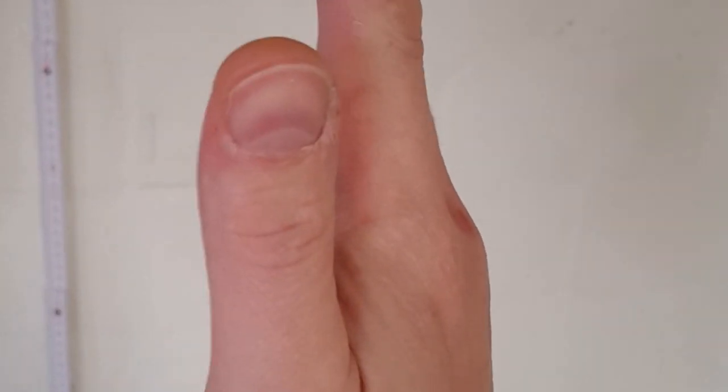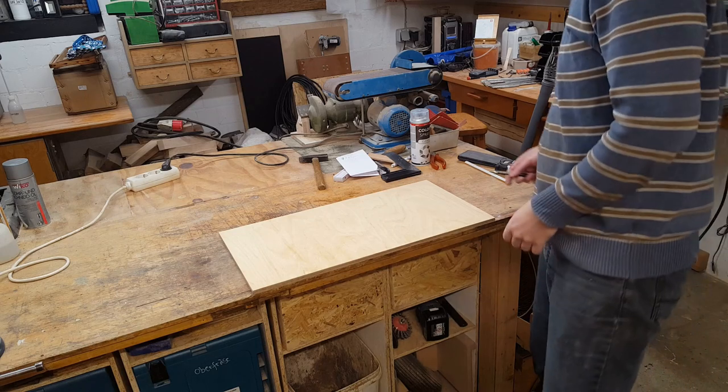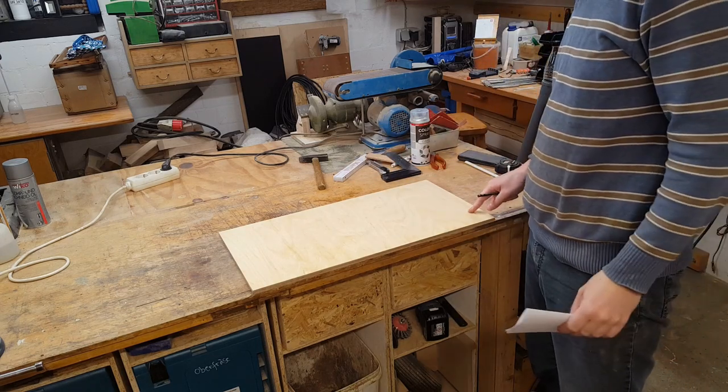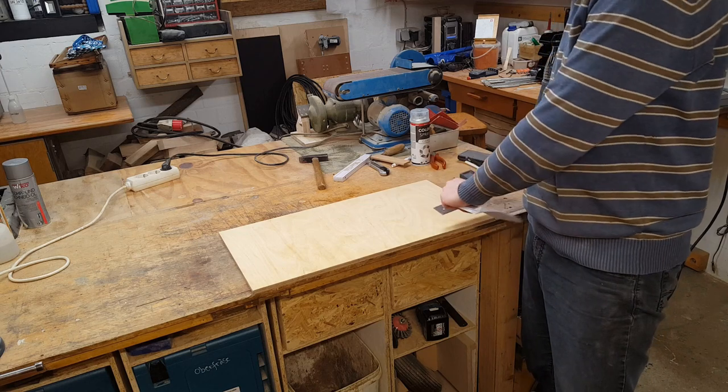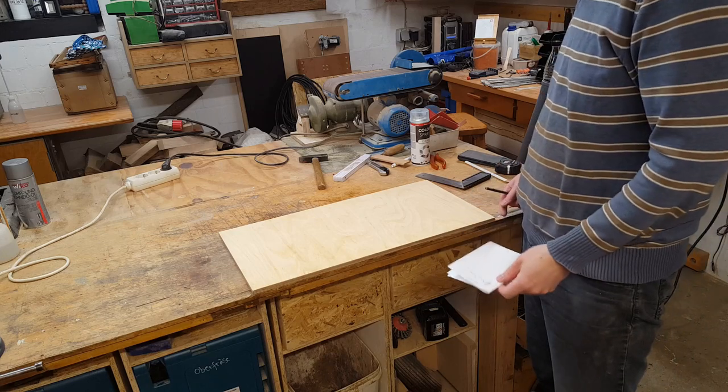So I've checked now where I want to put the French cleat pieces to attach my pipes. And I've located 7 places and one at the very bottom, to avoid that the pipe tilts, so it has a backer at the bottom. Let's do some quick thinking. I need 7 strips. I set 4 centimeters, this width should be okay, with a 45-degree angle at each side.